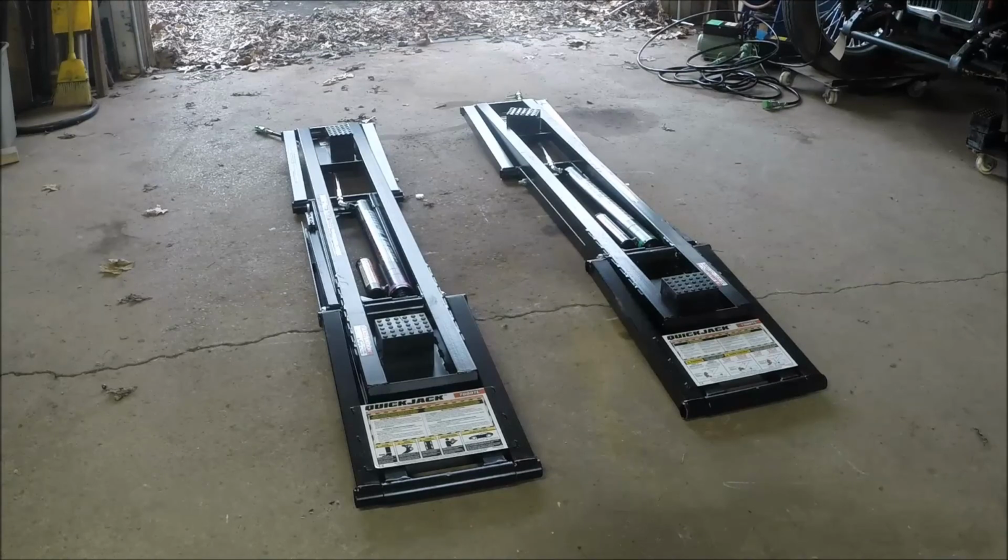Other than that, they seemed to work, seemed to be pretty good quality, other than the Chinese goop they give you for the fittings. And, you know, who knows, maybe it's okay if you let it sit 24 hours. I just didn't like it. Went and bought some good high-strength U.S. stuff, still let it sit 24 hours, and I don't have any leaks. So it would be nice if they used fittings that didn't require pipe dope, like the fittings on the cylinders where the lines screw on. But that's, you know, save a penny here, penny there, make a buck. And if it works, it works.